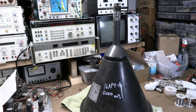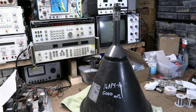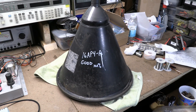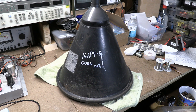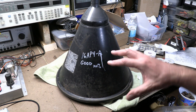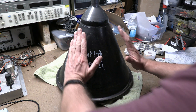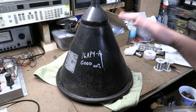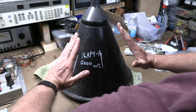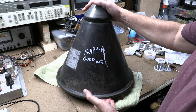According to the label on the side here: good 100%, 16-AP4-A. I believe the A means it's tinted glass. Let's take a little look at the front of this. Also, notice how crazy long this is — this was early 1948, 1949, and they still had really shallow deflection; I think this would be 53 degrees. Very shortly after they came out with the 16-GP4, which is 70 degrees, and later they may have had 90 degrees — they started getting shorter and shorter, and the cone started getting flatter and flatter. This is the first gen.